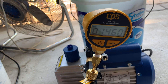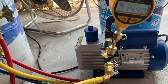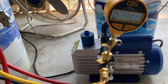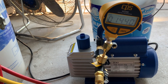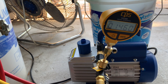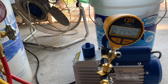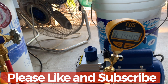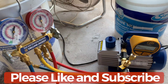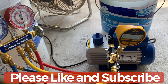That's the test — it tells me that my setup is nice and sealed, my hoses are good. That's pretty much how you test your gauge and your setup, and even your pump. Hopefully this helps you guys. If you want to test your system without being connected to an HVAC system, this is probably the best way to do it. If you have a spare outside unit sitting in your garage, that's great for testing too. Please subscribe to my channel and like the video — thank you very much.